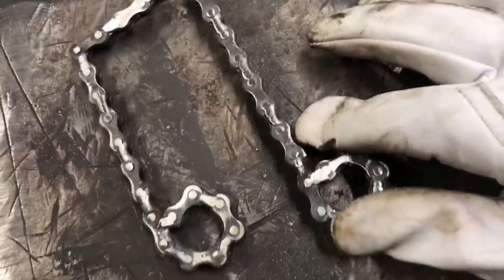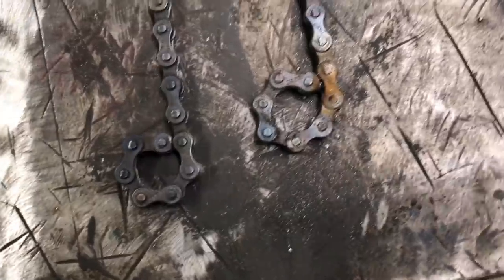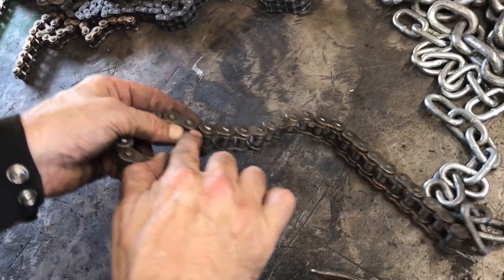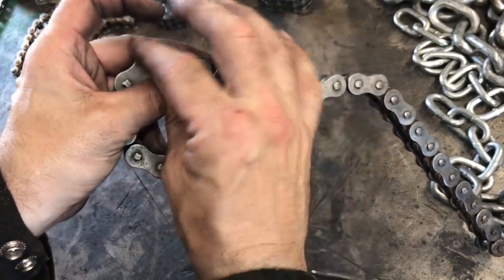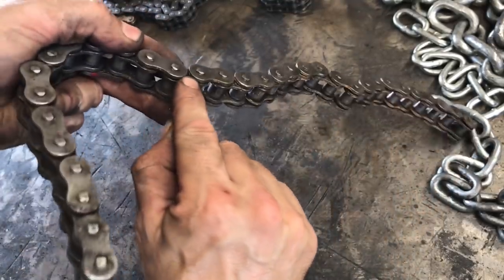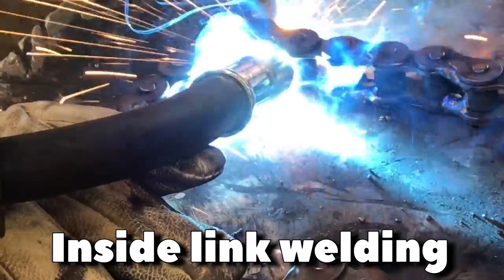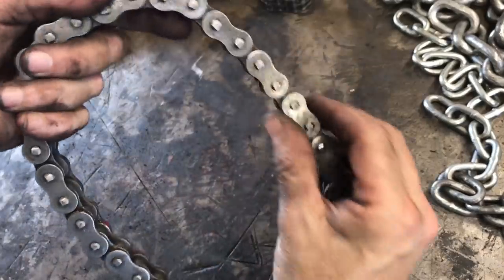It's a cool little craft art piece. Now that this is all welded solid, there are no weld marks on those chain links. What we're going to do when we weld these up is try to get it as close into this little section here. We can also just weld that solid, except if it's going to be facing the back so we won't see the welds — that's great. But if you need to, you can start tacking inside here, and later on you can weld up these links so there won't be any weld look on the outside.